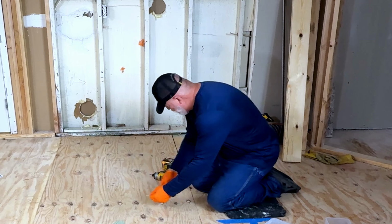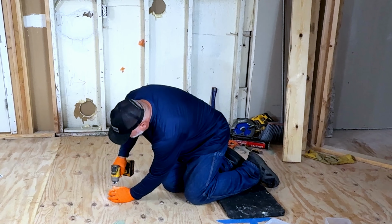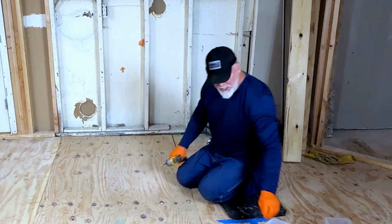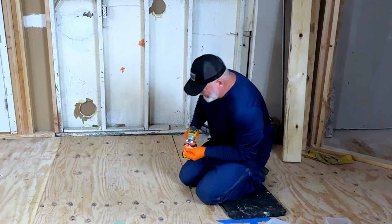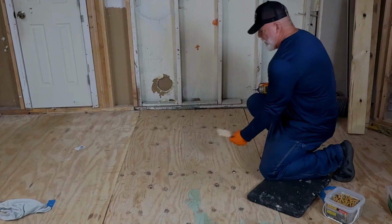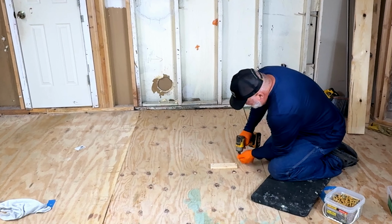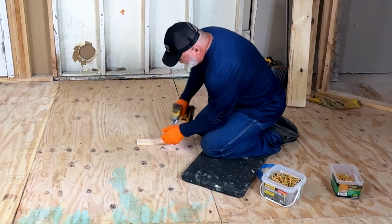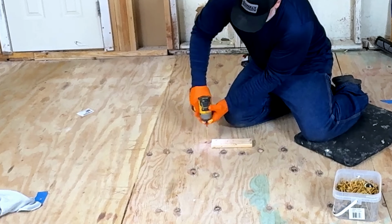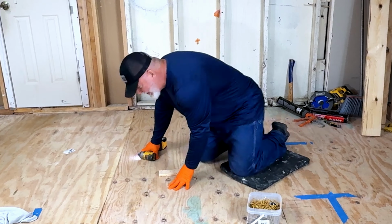Now what I will generally do, I will pick one of my centers, go into it here, and I'll pop a center one in. Right here, and I make sure that it goes underneath the surface, and then I will start fanning out, and you will go about 8 inches or so. You can use a block like this and space it out with that, which makes it just a little bit easier to make sure you're dead on. See where that pulled that down nice and flat.